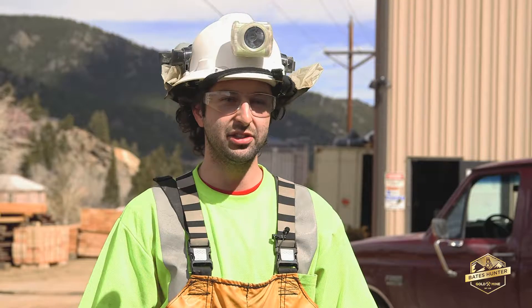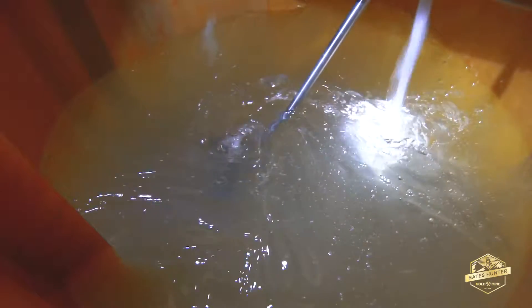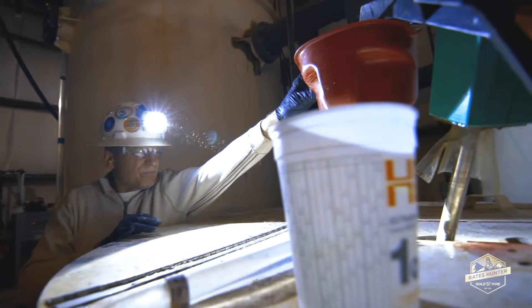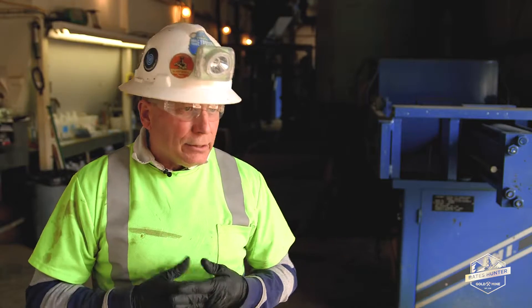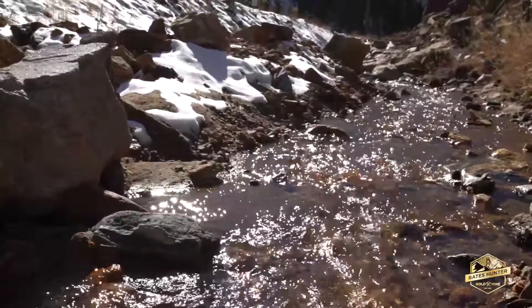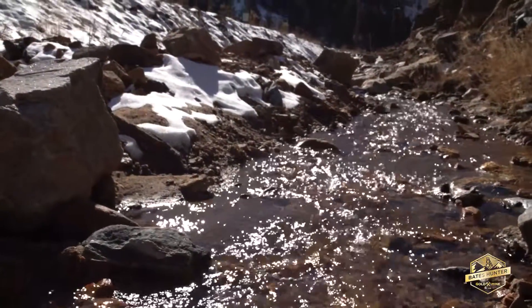We add an acid to the water to bring the pH back down. In the pH adjustment tank, there are several different things you can use, but we add sulfuric acid, which by itself is like a 2.8 — very strong. But we add it and bring the pH to 7.5, which is where we're discharging at.